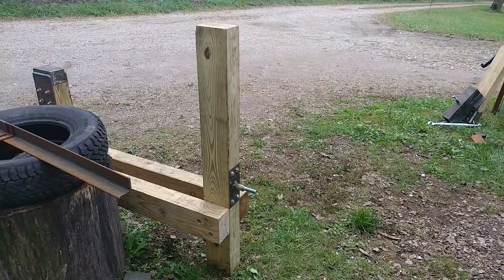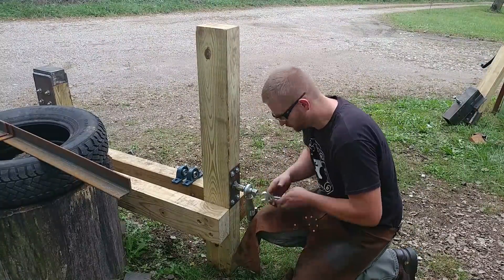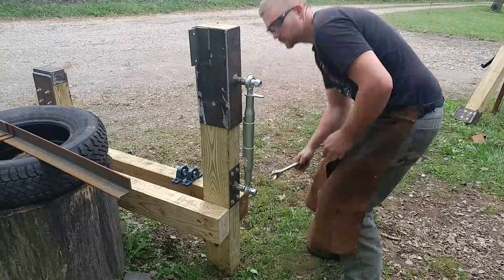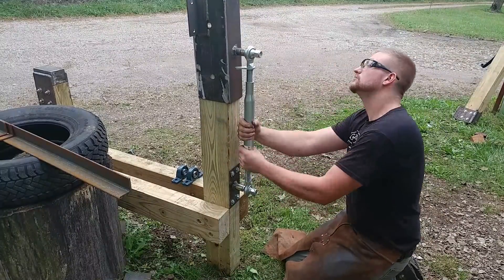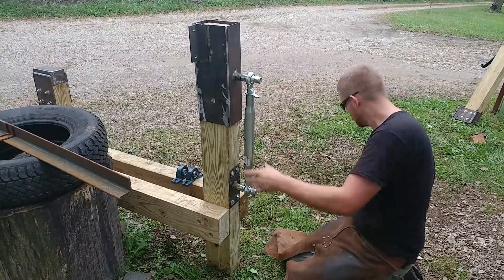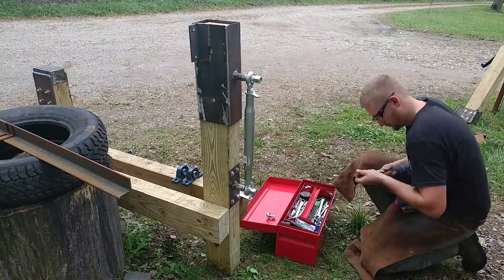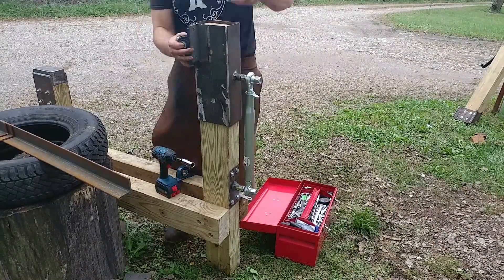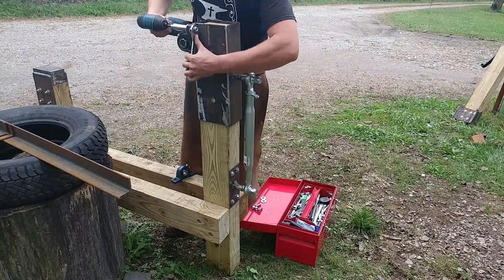You can do through bolts if you like — lag bolts are sufficient, but through bolts work too. The lag bolts I'm using are five to six inches long in a six-inch beam, so they go in fairly deep and they're not coming out. Now you can see the action of the traveler. This allows you to adjust the hit point, hinge point, or fulcrum to allow you to work taller tooling underneath the beam hammer and get things to come down and hit square and in plane.